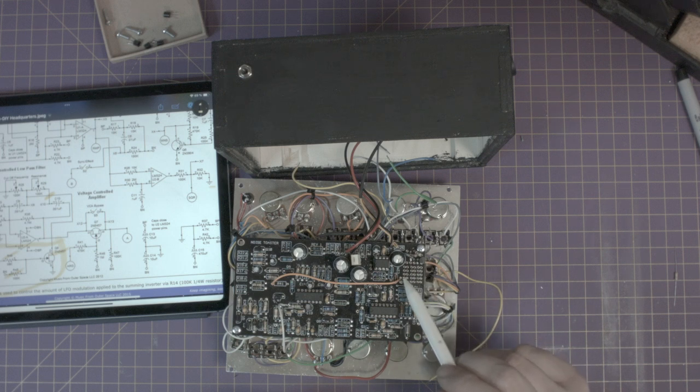The clutch area has connections to both battery positive and battery negative at these 2 spots. You can test this with a continuity tester between the hole and the trace mark BP and BN respectively to make sure. We've already used battery negative for building our extra VCA, and to make it simpler for myself, I use the top leg of R69, which is also connected to battery negative.